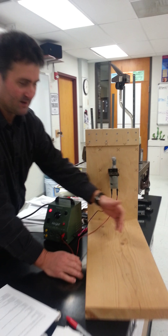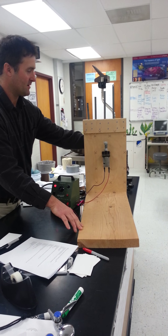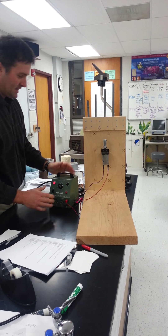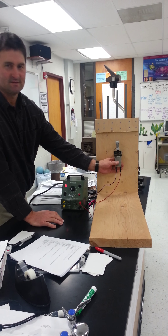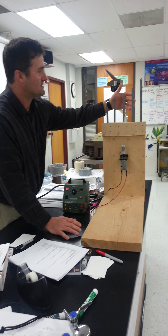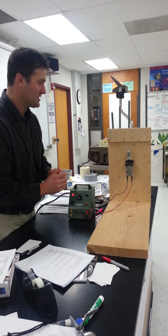For this setup, I just have a 2x12 piece of wood, and then I've got thin plywood here, and then an electric motor that's got a counterweight on it, and I just run this with a power supply. This is a 12-volt motor, and then these are all different hacksaw blades that are cut at different lengths to show the different frequencies that we have for vibration.